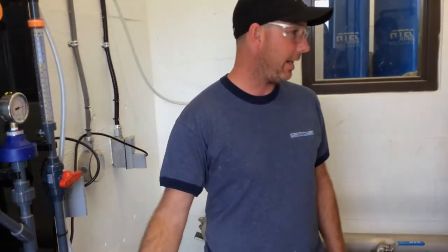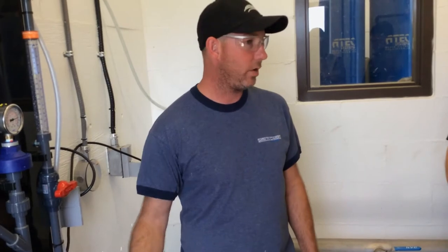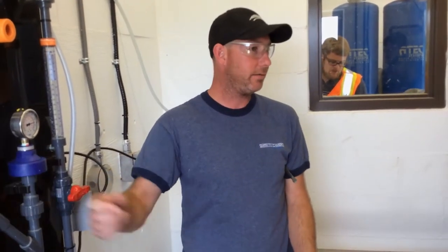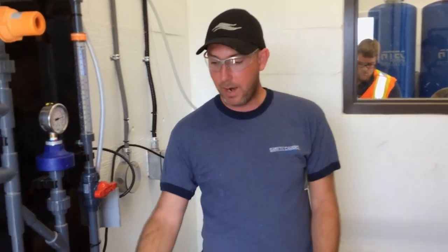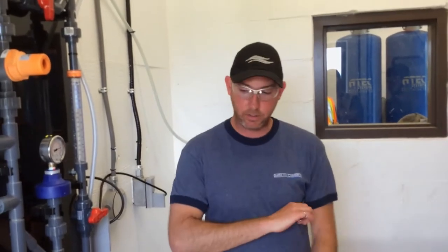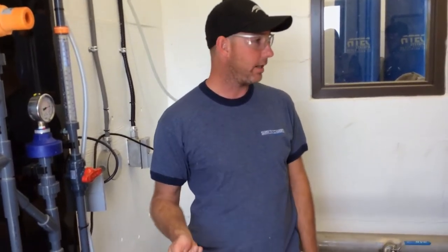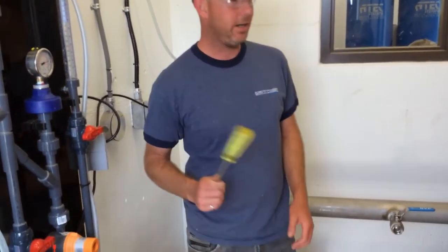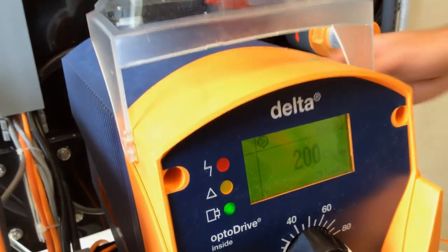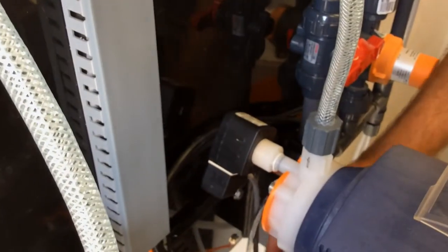It'll start making louder noises when it has gas. When it pushes that diaphragm out, it's monitoring how hard it is to push it out. When I'm pushing against 100 PSI, it's really hard, but when I don't have any liquid to push out, it's really easy to compress that gas. So it starts making funky, loud knocking sounds, which are fine. But you hear that click? That click is this solenoid opening. So it says, I just sensed that it was really easy for the diaphragm to go out.